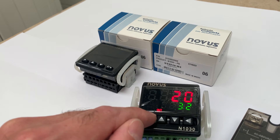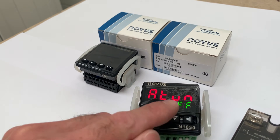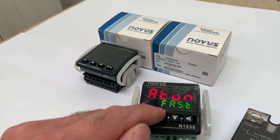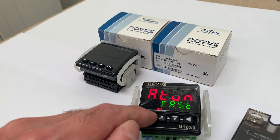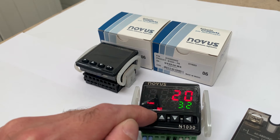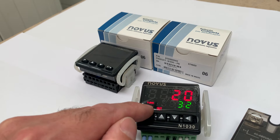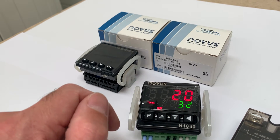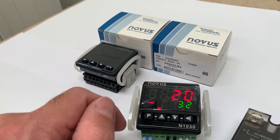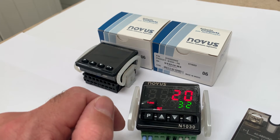For true PID you're going to need to auto tune it. Press and hold. Fast auto tune normally suffices for most applications. Press and hold again. And you can see we have our tune light now. So it's going to take it up to set point two or three times and then pre-fill in some values for the PID. And really, you're up and running — it's that simple.